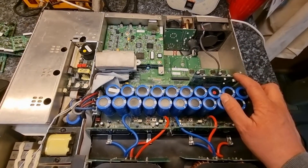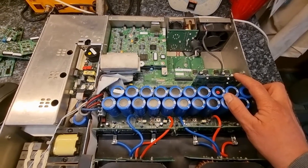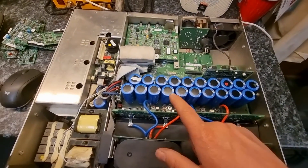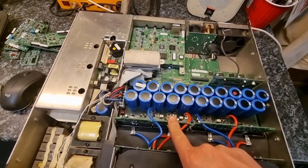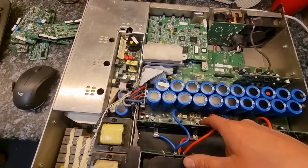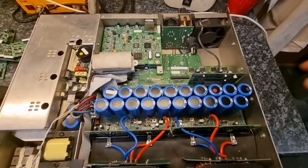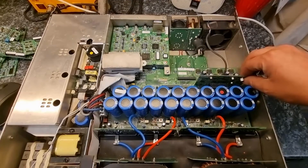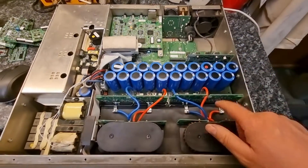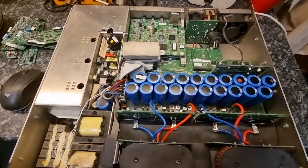You can safely power up the amp without a front-end driver card in — that's fine. Swapping one around isn't risky, provided that you've done the basic checks on the gate driver card and also that the reference or supply rails generated there are okay. I don't think I've broken a front-end card. In the process of learning how these all work, I have damaged several gate driver cards, but fortunately I've managed to repair them.